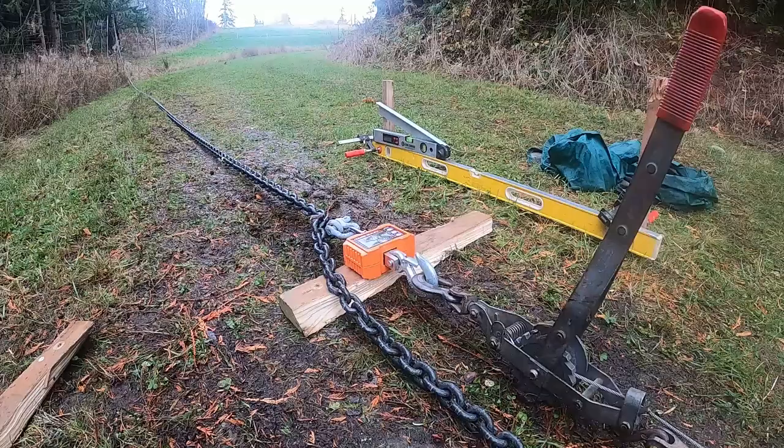This is Panope's actual anchor rode — three-eighths triple B chain. I've marked off 105 feet. Down at the lower end of the chain, which we'll call the anchor location, I've got a come-along and a load sensor. The far end of the chain is up in a tree, 30 feet above the anchor point. This is the exact setup that I use for the bulk of my large anchor testing when I use Panope. Now, there are two errors in this test rig that we need to discuss, and I believe the two end up canceling each other.